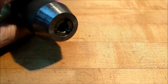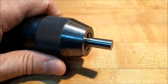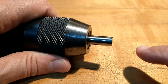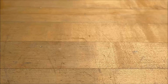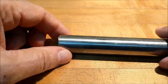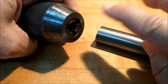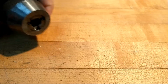Drill chuck. Let's start off with the drill chuck. Find the max diameter you can hold in that drill chuck with the jaws subsurface. There will be one. So figure out what diameter that is and write that down somewhere. That's part one. Part two is grab a piece of material off the stock, cold roll, brass, it really doesn't matter. But if you can, make sure it's bigger than this opening right here. Just a little bit bigger.